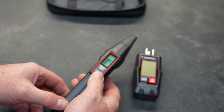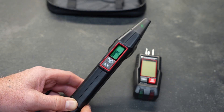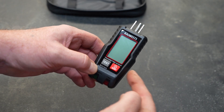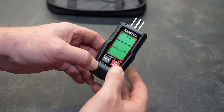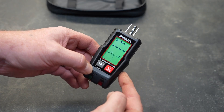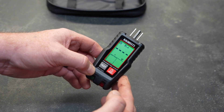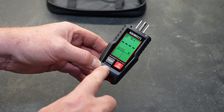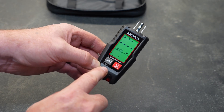You can turn the flashlight on and off as needed. It also has a reset button, because every time you use it you technically calibrate it — we'll talk about that in a second. The transmitter also takes batteries since it is going to transmit. It has a power button, and not only is it a transmitter, it's also a tester — it's going to make sure that your ground, neutral, and common wires are all in the appropriate places on your receptacle. It will also test a GFCI circuit.